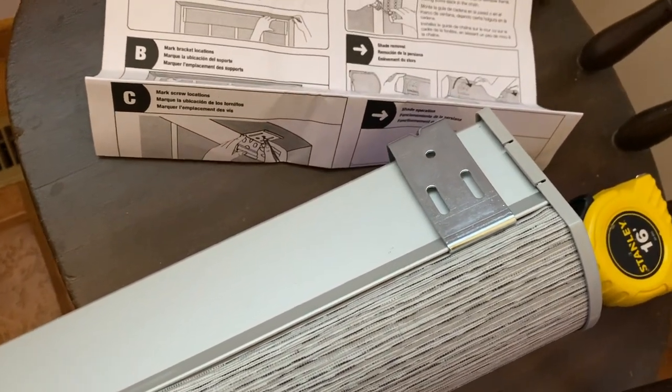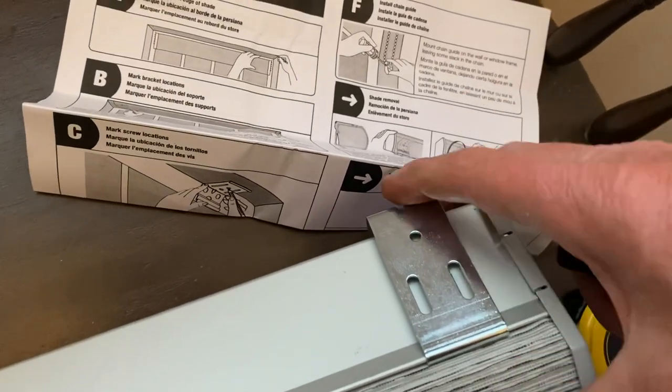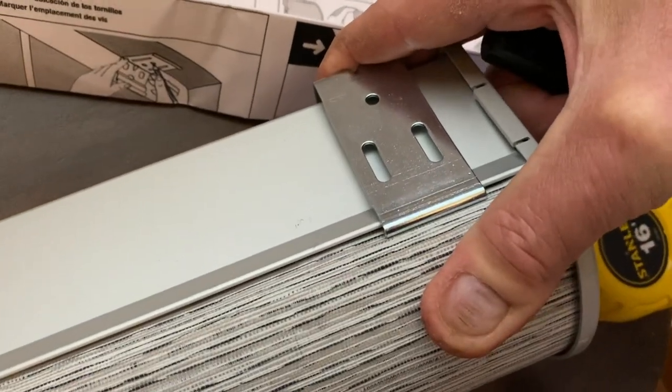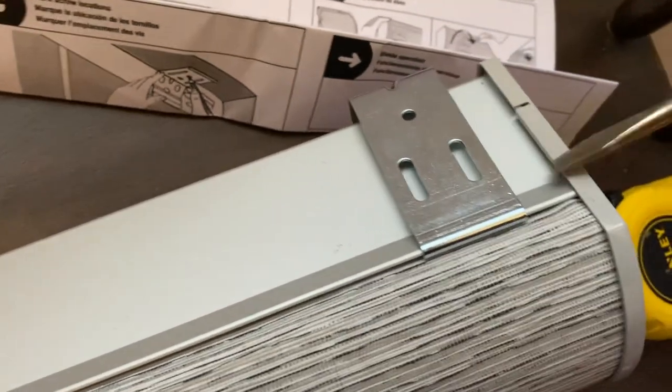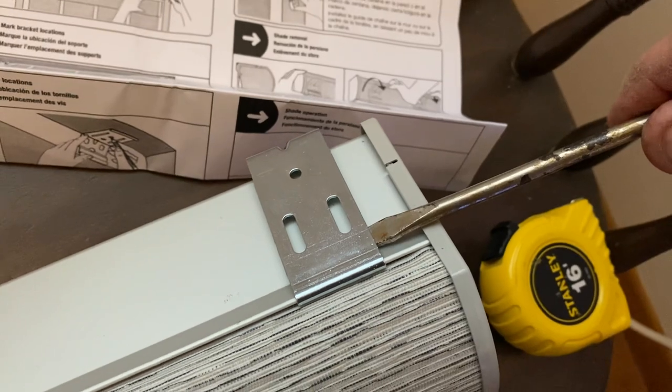In this particular window, the brackets are coming off pretty easily. With two hands, press that in and you can see that's going to release the top clip. You're going to have to get in with a second hand and gently lift that up.